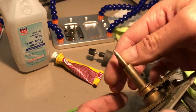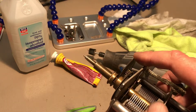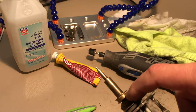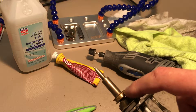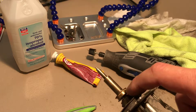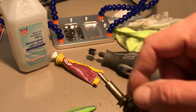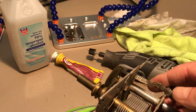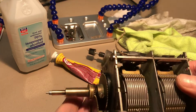For any areas where you have movement, add a little lubrication. One place you do not want to get any grease or oil is the drum here where the string for the tuning mechanism ties to — you don't want any slippage there. That's a good place to go over with a Q-tip and some alcohol, and really make sure that's a nice clean, dry surface. Let me keep working on this and I'll check back when we make some progress.